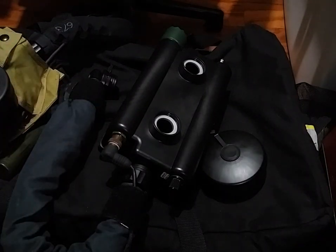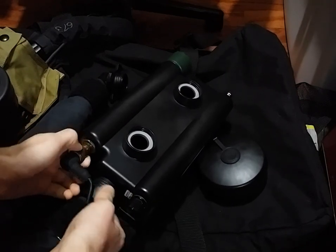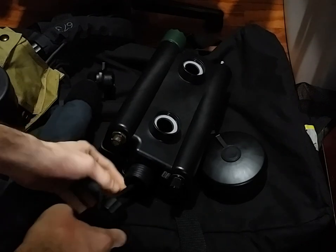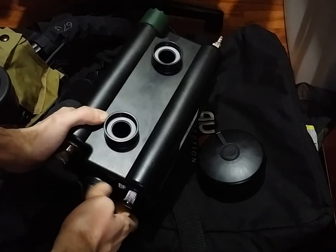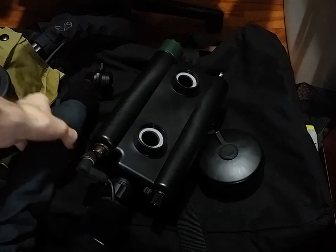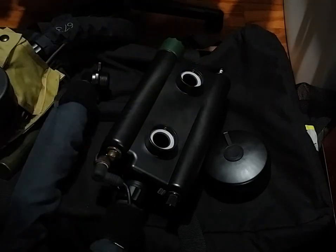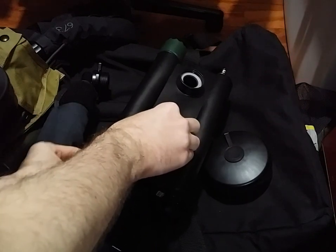I'm not sure if it makes a perfect seal, but it's definitely an interesting quirk they added to the design. I'll try and show a photo of what that looks like at the end of the video — just believe me when I say it is a cluster inside this unit. Another interesting thing I never figured out is this little — I like to call it a cannula. There's a long length of silicone tubing that goes inside the hose like a big tapeworm, and on the other end there's a little plastic bit with a couple of holes that allow air to come out. I believe this is the airline for the SCBA function — when you inhale, the positive pressure would be forced through that hose. They're trying to restrict as much air as possible for the SCBA, probably to conserve air under pressure without high-pressure fittings inside.